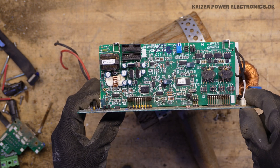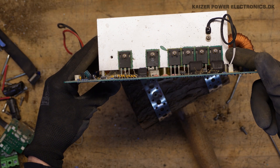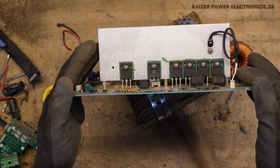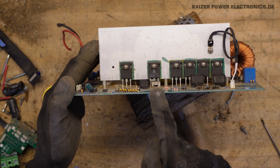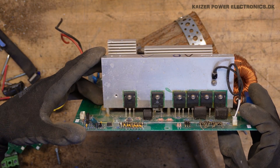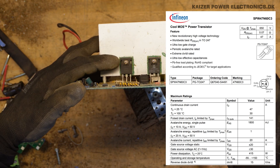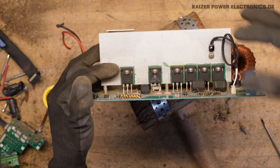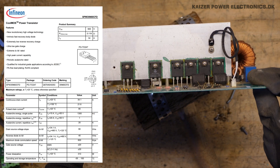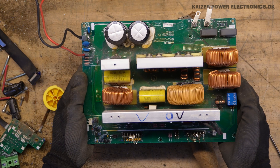Let's get this pulled off so we can see the inverter behind. We have some kind of full bridge sitting here — judging from the bottom side, that is a full bridge, connected with two as the outer legs and two inner ones. Here we have most likely a diode and another IGBT. It's hard to make out the writing, but it reads 47N60C3 Infineon — that's most likely a MOSFET. Over here we have again Infineon switches, these are 35N60. Not quite sure if those are MOSFETs or IGBTs, but from the part numbers most likely MOSFETs, as IGBTs tend to have rounder even numbers.